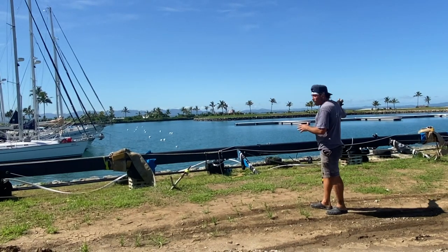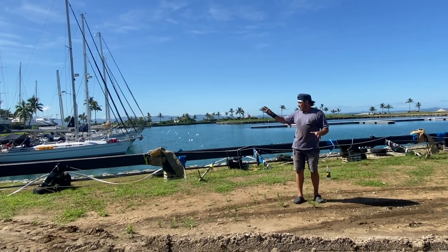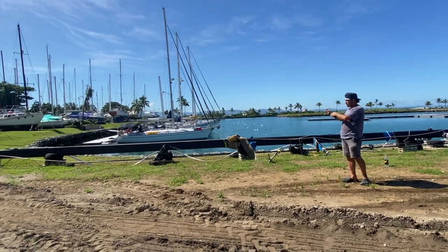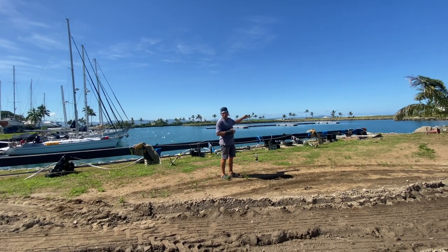To do the movement, we'll use a crane and it will lift up the mast using straps attached at two points. So first we had to decide where to attach these straps so that the mast would be balanced. There's more weight at the base than at the head. That's why our straps are positioned more towards the base.